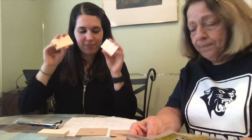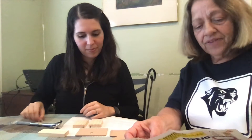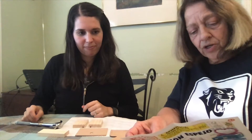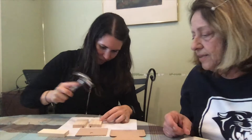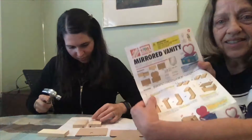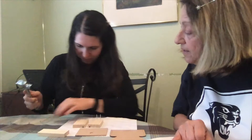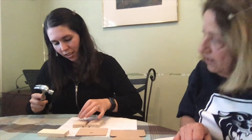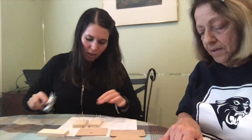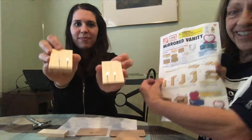Step one: place both side pieces flat with the nail holes on top and the slots facing down. Start four long nails — tap it a little. When it says 'start' it means just get your nail in just a little bit; it doesn't need to go all the way through yet. Just so it can stand on its own. That was step one.